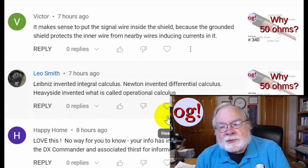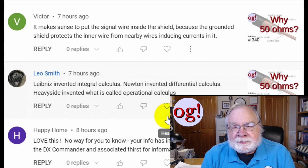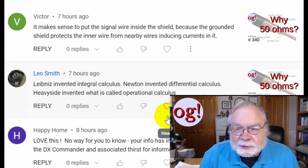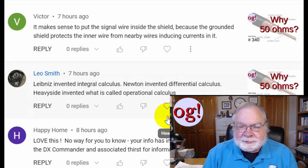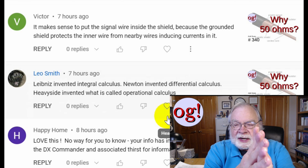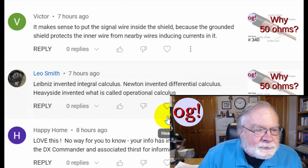It's number 340. It's one of my most popular videos. Why 50 ohms? The question is, why did the military settle on 50 ohms when a different impedance was best for transmit and a different impedance was best for receive? I made the point that it was a stroke of genius to take two parallel wires and put one wire inside the other so that the electricity could get there without interfering with anything nearby.